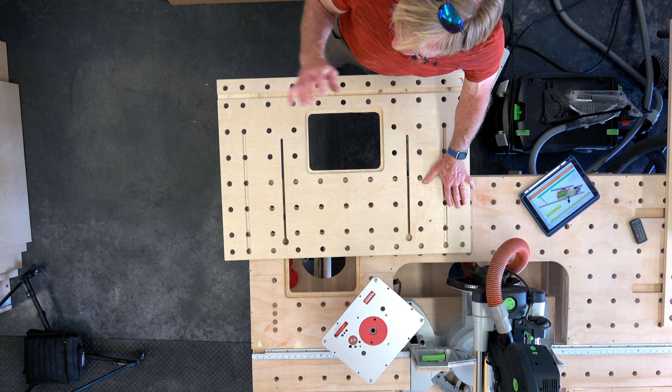I'm using this as a finish carpenter, running trim and trim boards. I'm not putting 8x12s on this — that's framing, a totally different set of tools. These are specialized tools for finish work, and there's so much specialization in finish work that I want to design this router table specifically for that. So I achieved that and I'm pretty excited with the way it turned out. It is a single piece of 18mm plywood — no strong backs, bracing, or anything like that. It doesn't need it.